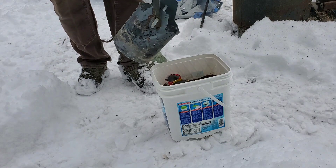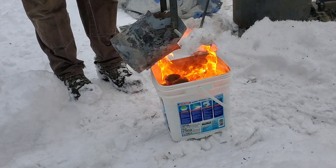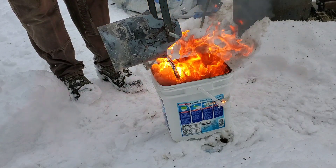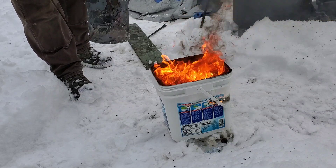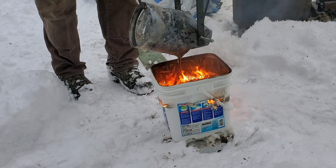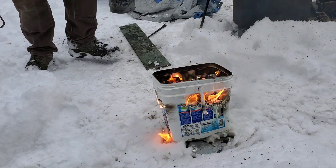Check out the notes below for the minimum PPE you should be wearing. And you see this hesitation here? This hesitation probably caused the failure of one of my parts. With lost foam casting, you can't pause during the pour — if you pause and it runs out of metal, the sand will collapse. I wouldn't suggest pouring on snow because there is a chance that the metal will spit. However, the snow does work quite well as an extinguishing agent.